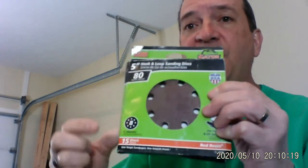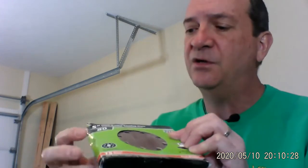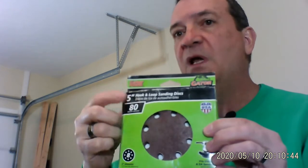Packages of sandpaper will also indicate how many holes. This has got eight holes in it down here — it'll tell me right here at the bottom. So you know you're getting the right one. Of course you can count the holes, but when you go to the store and say you need sandpaper, you just tell them eight, six, or four holes. This will also tell you the grit. The lower the number, the rougher the sandpaper. You can get it in 40, 60, 80, 100, 120, 220, and higher.